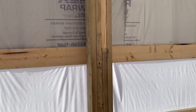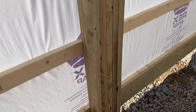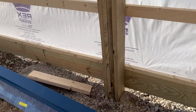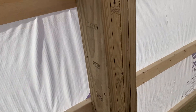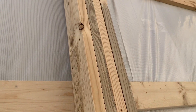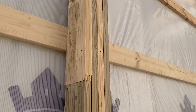If you've been following along in my previous videos, you know there are different options — you've probably seen the concrete perma-columns. These are actually four-ply. Look at the structural strength on these. These are four-ply two-by-six. On a bigger building you need something a little bit stronger. You can see the pressure point there, pressure point there, pressure point there, and pressure point right there.